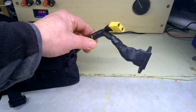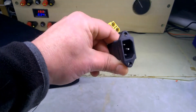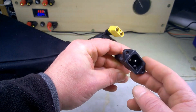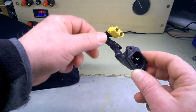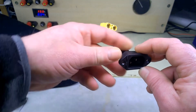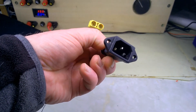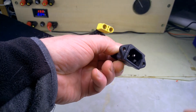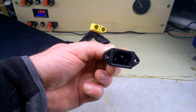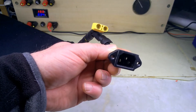There are two connectors — the plastic bag cases can short out against a screw or something. That's the first dangerous thing to see. That's an IEC plug — I assume one's for charging and one for power. The one with thicker wires is probably the power output. That's dangerous for a start. In the UK that's called a kettle lead, and it fits directly from the mains. If somebody didn't know, you could plug that LiPo straight into the mains — very dangerous.